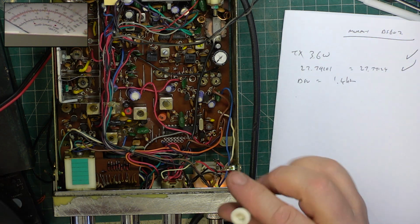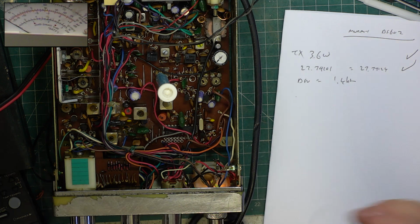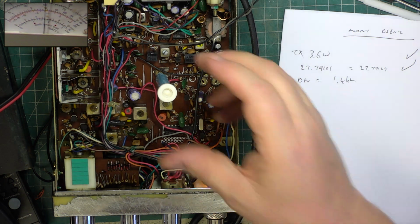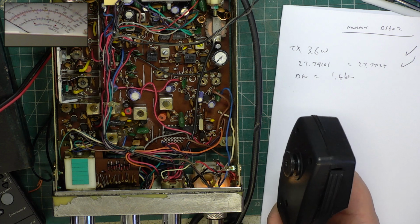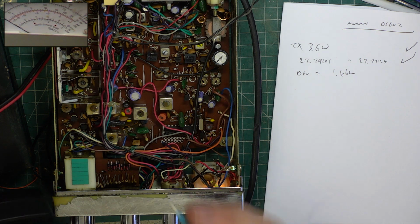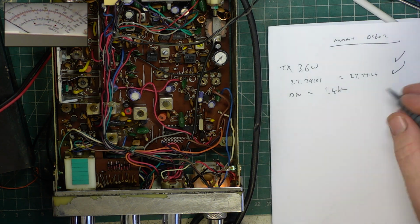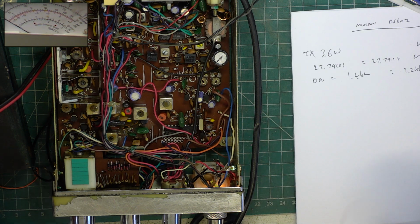Why have we gone off tune? So we'll just try it there. Yeah, I guess that's spot on. It's not always obvious where you're going to be putting the microphone, where that oscillator is, and what the reading is from that to what the voice is. So that was pretty good. So it's now 2.2 kilohertz to a maximum of 2.5, an absolute maximum. Not like 8 like that Thunderpole T2000 the other day, which was transmitting on 3 channels at once.